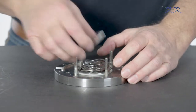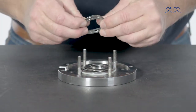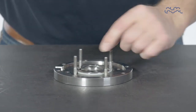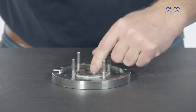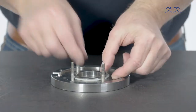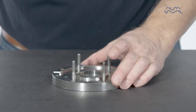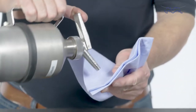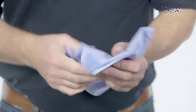Next, remove the O-ring, springs, drive rings and retainer ring. Clean the seal surfaces using alcohol to make sure that they are completely clean prior to seal replacement.